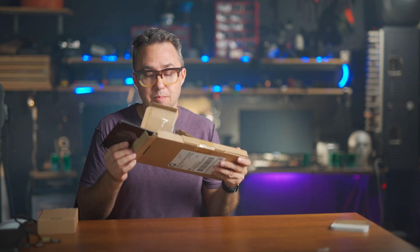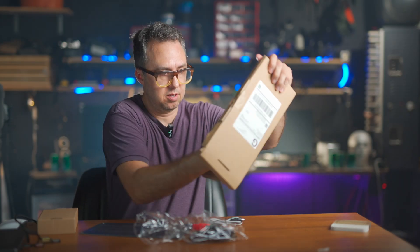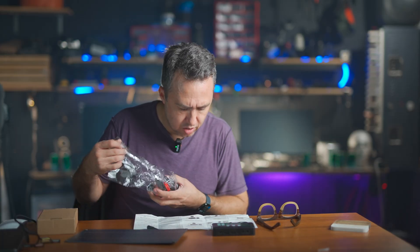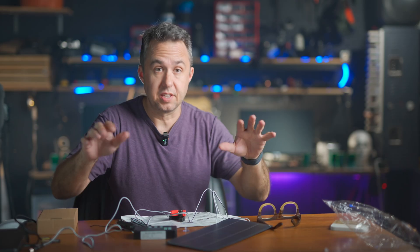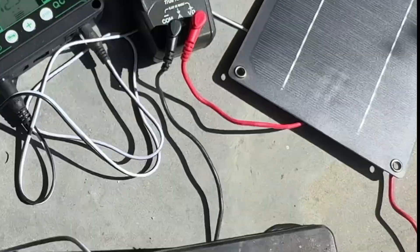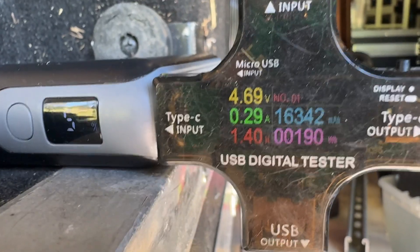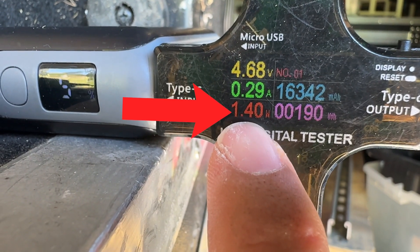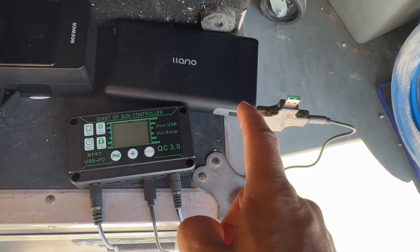I am really sure this said a 200 watt solar panel system. If you know anything about electricity, I'd be surprised if we can get 20 watts out of this. But let's see. It comes with connectors — looks like it's meant to charge up a portable battery, probably meant to charge up a 12-volt battery. There's a USB-C out and branded alligator clips. We'll test this one in the daytime tomorrow. Did you know the warehouse has a backyard? That says 13.7, and it is indeed putting out 13 volts — that's great. While it's charging the battery, I have a USB power bank meter here. It's charging at 1.4 watts. It does work — it does do what it's saying it's doing. It's putting out the correct voltage for a 12-volt battery and USB voltage for charging USBs.